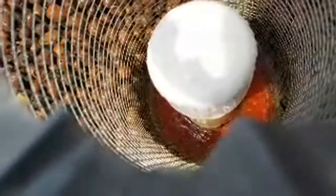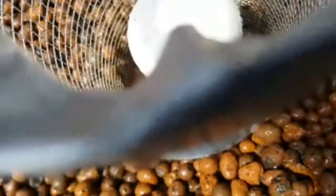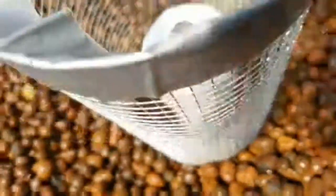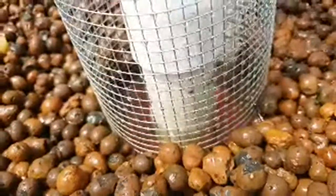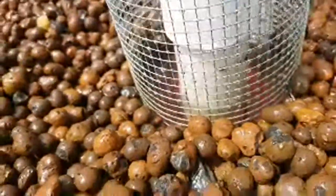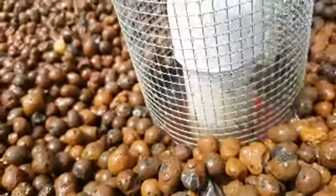Do you see any drain? You look down there and tell me when it stops or diminishes. I hear it still slurping. Oh, stop. Did it really stop down there? Yep. All right, that is the moment of truth. So it now bubbled. It created a bubble and stopped. That is T0. And from that moment, we could then calculate how long it takes.